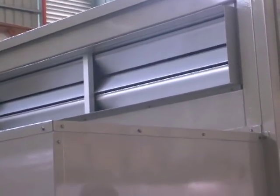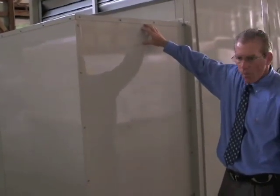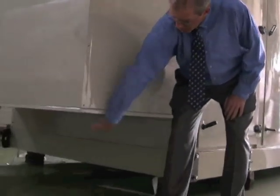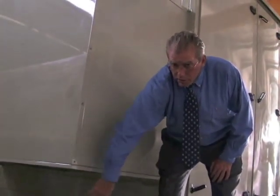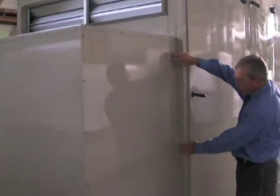I'm going to take you through the machine in order of air flow. This is the outside air hood — the hood we developed just for Dow. On the bottom is just a bird screen so there's nothing to get clogged, and the actual air comes in here vertically, so even in a blinding rain we are not going to pull any water into the machine. It comes up into the cabinet and then enters through here.